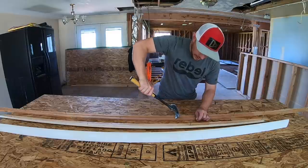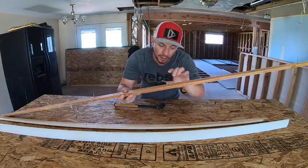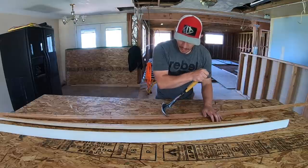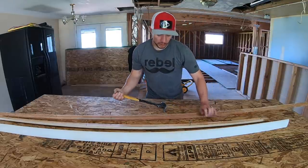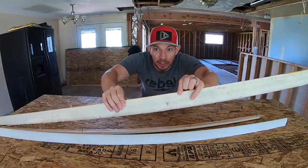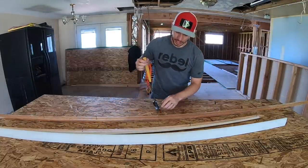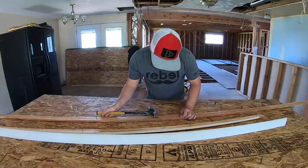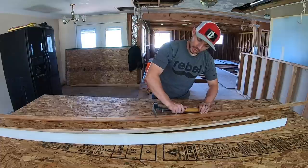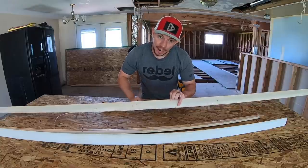First, I take my hammer and put it on the nail and bend it over once — it's going to put a curve in the nail, and that's what we need. Then you take your hammer and put it opposite, pinch on it, and pry — and it pulls that nail all the way out. You can't even see any damage on the other side. Now it's ready to go back on without even having to repair a hole. Pry it, then come back the opposite way, put the nail in between the claws, pinch, and it'll pull. It's a clean finish every single time.